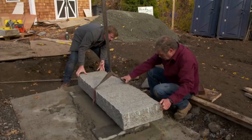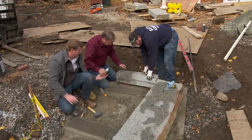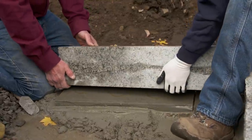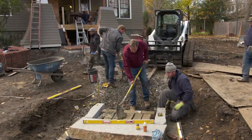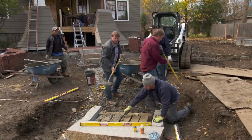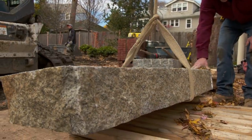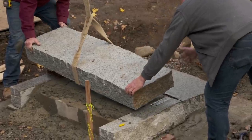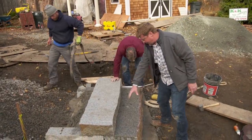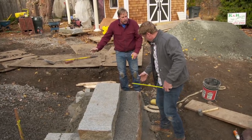Got to come forward. This is a cheek, and this is going to sit on top of our shim. You won't see underneath — all you'll see is granite. I'm going to use those solid concrete blocks to fill in the space instead of just filling it in with concrete. Line it up where you want it to be. You're actually a little closer to the front edge here of this first step and back some there — right, that's to make our radius going up to the house.